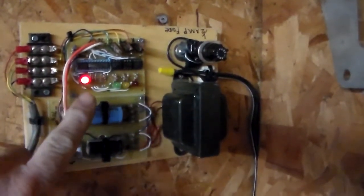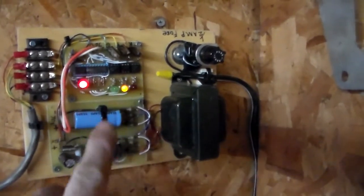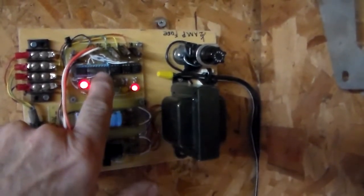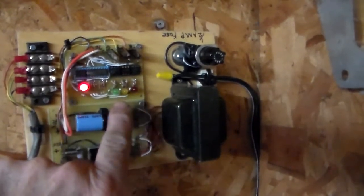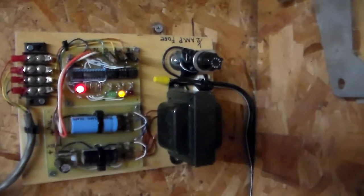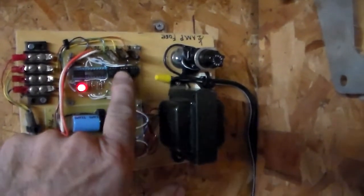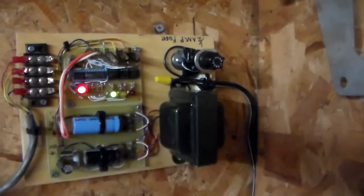You can see the LED here — that's the clock pulse from the 555 chip. It's triggering the 4017 counter chip. And then you've got your corresponding green, yellow, and red LEDs. Those in turn fire the optocouplers, which turn on the MOSFETs for the lights.